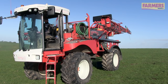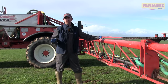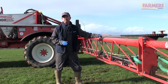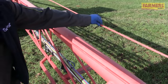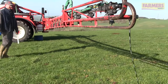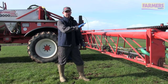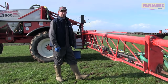Moving forward, opening the boom out, you'd then be checking that it's loose and has good free movement but not excessive movement. All machines are different so I'd recommend checking with your specific manufacturer as to how they set the boom up. But on the Bateman there are tie rods and stock bolts, so by adjusting them you can set the boom up to ride really well. The rule of thumb is: just on the tie rod on the back, a bit loose but a bit of pressure with your centre finger, and the front one tight when opened out. Then you'd be checking for up and down movement so that if you push it up and down it returns to the middle, and also fore and aft movement. You want a little bit of movement but not excessive so that you can ride over the bumps as you're going along — it goes backwards and forwards two times and settles nicely in the middle.